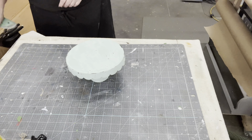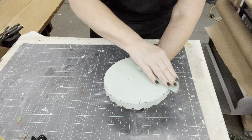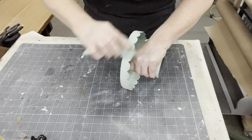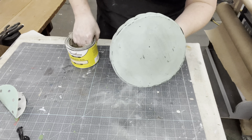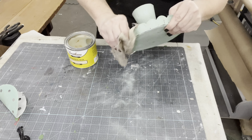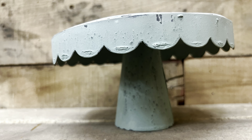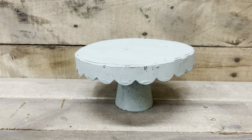I don't want to overwork it - wherever it's spotty I just let it be spotty. Since it's really a one coat coverage, I think it just turns out amazing and really gives that aged effect. I'm just taking some 220 sandpaper to make sure that everything smooths down - it sands down with sandpaper really easily and it's just a neat texture. Now I'll just get it sealed in with some clear Varathane natural wax. I can't even explain to you how smooth the paint feels after you sand it.